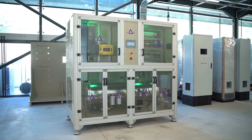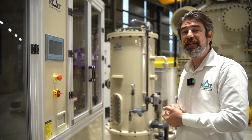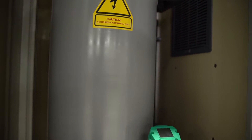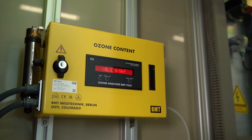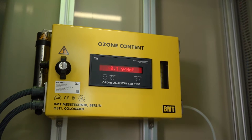In the very heart of the system, we have a complete MAD Cooling built-in ozone generator, which can go up to 15 kilograms per hour with our water-cooled corona reactor and all necessary control components, valves and measurement units. We also have inside each unit an online ozone measurement display, so you can check the production amount every second.